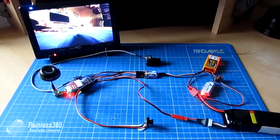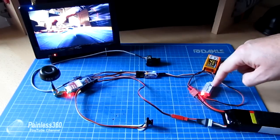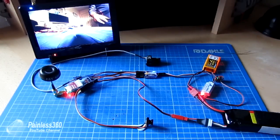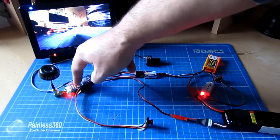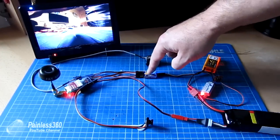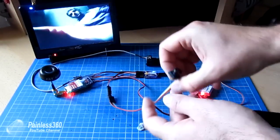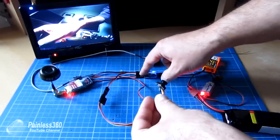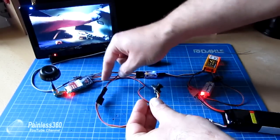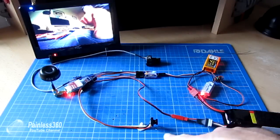A couple of bits of advice to be careful of. I'm running both cameras off a five-volt UBEC since they're both five-volt cameras. Be very careful about polarity: the plus and minus on the FatShark system versus the inputs on the FPV switch are switched. I've had to make a little adapter cable that swaps positive and negative around rather than plugging the cameras directly into the switch. If you're careful with that, it'll work fine.